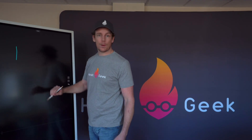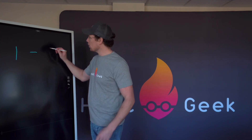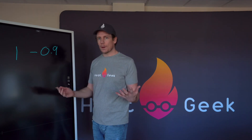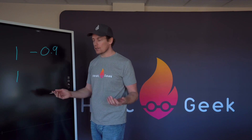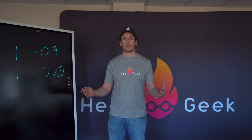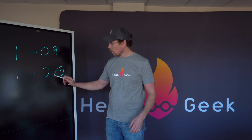So why do we want to move over from gas boilers to heat pumps? Put very simply, for every one kilowatt of gas energy we put into a boiler we get around 0.9 kilowatts of thermal energy back out. With heat pumps, for every one kilowatt of electrical energy we put in, we get between two and five kilowatts of thermal energy back out, lowering our carbon footprint as a country. This is known as our COP, or Coefficient of Performance - typically between two and five.